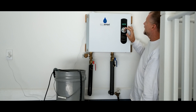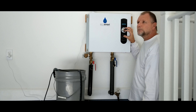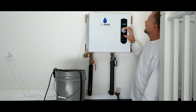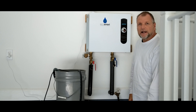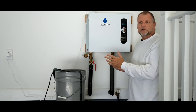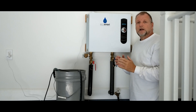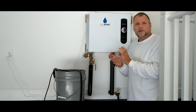This unit is handling two bathrooms, a washing machine, a slop sink in the laundry room, a kitchen sink, and two double-bowl sinks in the other bathrooms. It heats enough water for a four-bedroom house. The main thing to worry about with these units is they have a brass-type coil system with heating elements inside. If you live in a hard water area — you'll know because you'll get that white scale on your plumbing fixtures and faucets that doesn't seem to go away — that's calcium buildup.